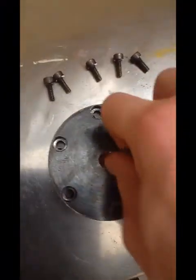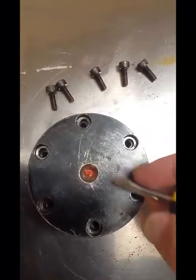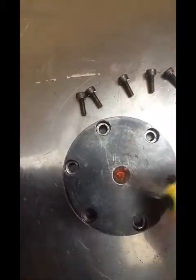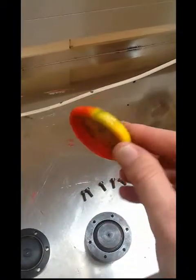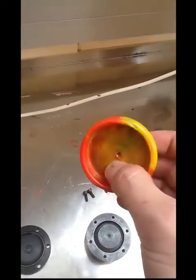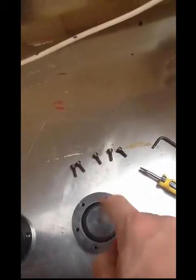One thing you might need to do — you see how there's a little nub of plastic in there? What you might need to do is get something a bit sharper, maybe a screwdriver. We need to kind of get that out of there, or if we can't, at least weaken it. Because that is going to make it difficult for us to pop that mold out. So just watch out for that — we might need to get in there with a screwdriver and kind of loosen that up. Just want you to have a look at that fine quality. Look at it — lovely. Now, I've got a bit of distortion at the edges. That could be because I didn't give it enough pressure — it didn't pull down on that handle hard enough, or potentially my allen key bolt things were not tight enough. So these are things that we have to be aware of when we're ensuring good quality.